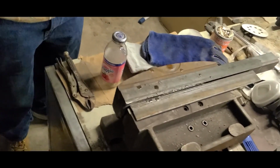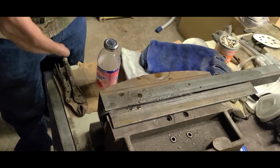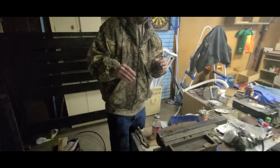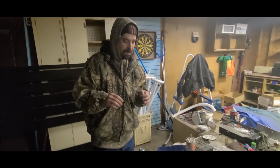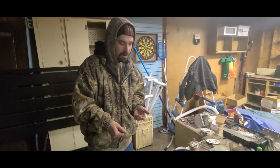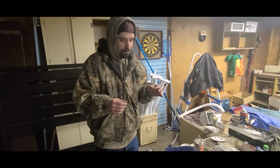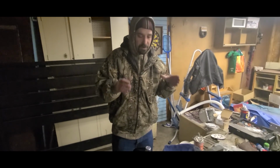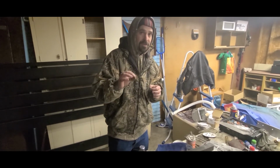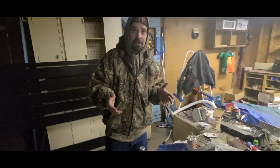All right, so now that we got a lockdown in the vise, we know that we're taking our warps out right now. So we're gonna allow it to cool down in here until once again where it's cool to the touch. So what we've done actually at this point is harden the metal to its most hardened state that it can possibly be in. But at that point, it's actually fragile. If you were to drop it or bang it really hard, it'll break like glass. So we now have to do another stage where we bring it home, put it in the oven at 375 degrees for 2 hours. And the reason for that is so that way we can actually soften it just a little bit to get it to the sweet spot where it's hard but still not fragile, essentially.